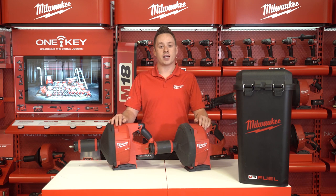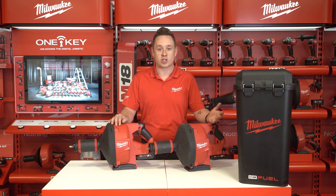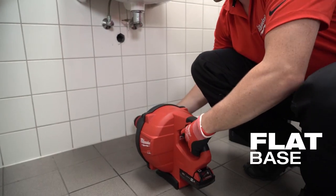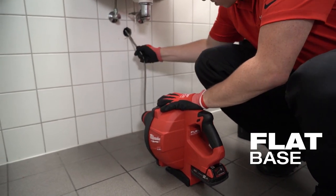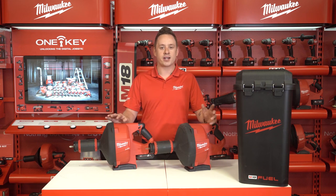Additionally, this provides the user with better mess containment as all the sludge that comes with the cable out of your drain is nicely captured within the drum. The second feature I will highlight is the flat base. Often one of the struggles with handheld drain cleaners is the possibility to put the tool down at the bottom of a cabinet, on top of a sink, or even on the floor. We realized for users that this is a big struggle and we therefore incorporated the flat base. We can simply put the tool down on a surface and have one hand free to guide the cable in and out of the drain, providing the user with more comfort and productivity.